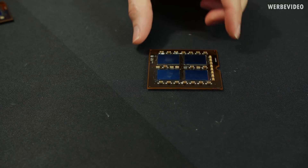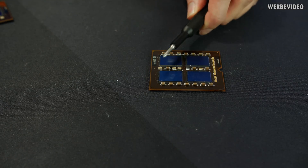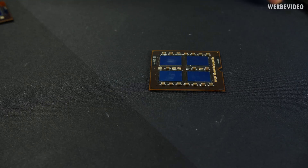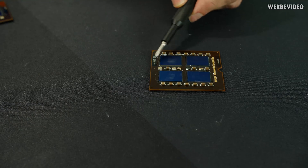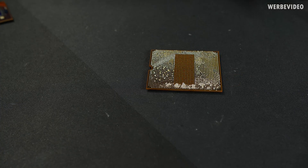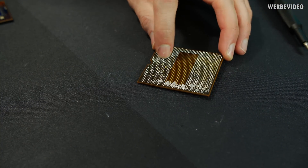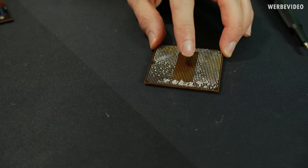Continuing with the more interesting thing, the cache PCB. As I said before, it contains four individual dies with one megabyte of cache each. It's interesting considering that nowadays a CPU with 32 megabytes of cache is smaller — the entire CPU is smaller than one of those one-megabyte cache dies. Flipping it around, an interesting fact is that the center part of the PCB was not populated with BGAs for whatever reason.